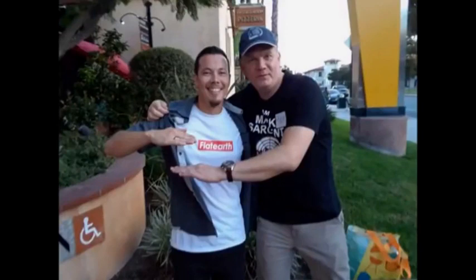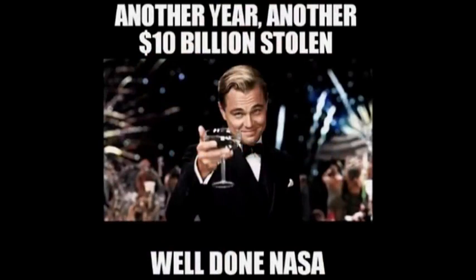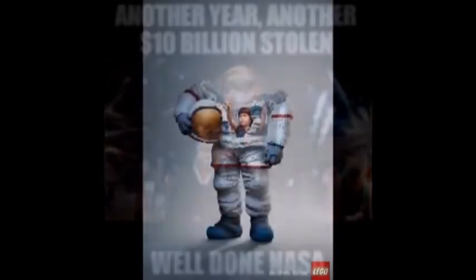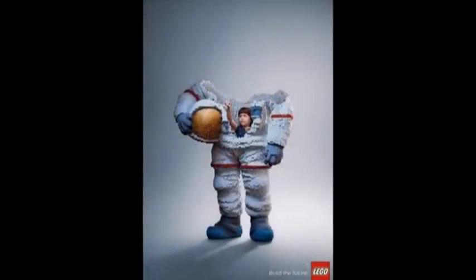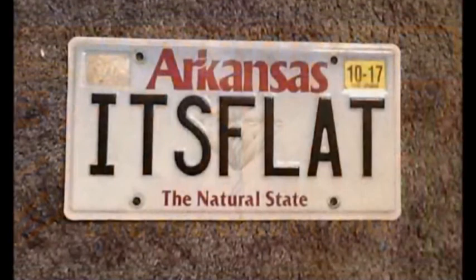Yeah. Basically what happens is those O-rings, in theory, roll as it's turning. Well, anytime you move anything on something else, you've got friction. So first and foremost, it would need to be lubricated constantly. Second of all, that pressure on those O-rings would not be a loose connection. It would have to be fairly tight, probably extremely tight. When I would close up a chamber, for instance, we had one tool, you'd have to go down and you'd have a torque spec for that. And you would have to do it much like you do a car tire. You do the star pattern so that it all lays down evenly so that there's not an uneven surface. And so those things have to be adhered to or it's not going to seal up right.